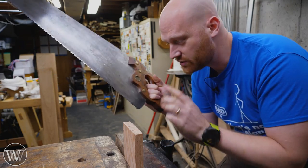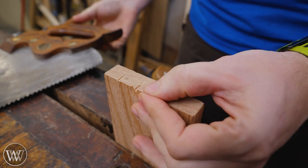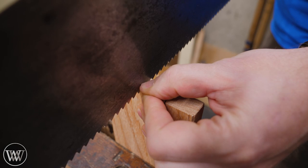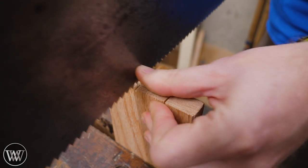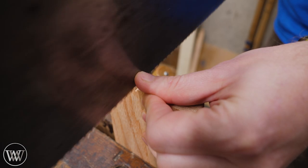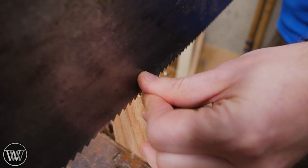The trick to that is your other hand. Your dominant hand is driving the saw, but your other hand is the one that's actually guiding it. With my other hand, I'm going to actually pinch the board — as I pinch, my thumbnail is going to push farther away, and as I relax the pinch, it lets the saw come back. I'm actually pushing the saw side to side with my thumb. The saw is constantly being pushed up against the thumb, giving me positive contact, so I'm just sliding against that guide. This gives me fine precision to push the saw one way or the other and set it exactly on the line to start the cut.